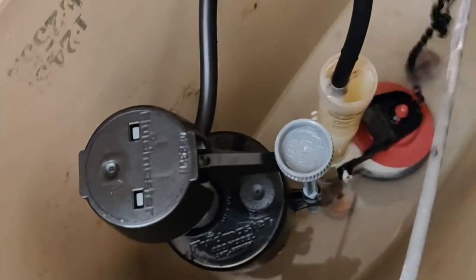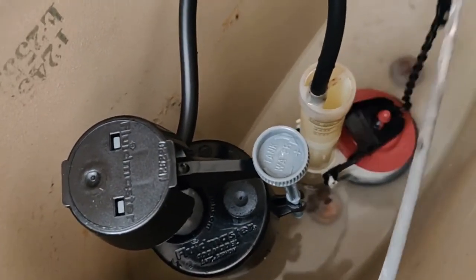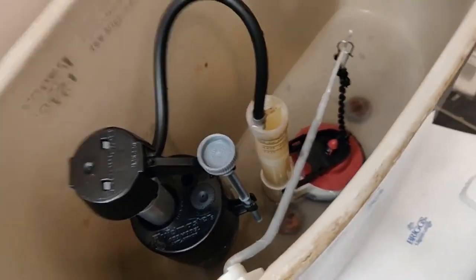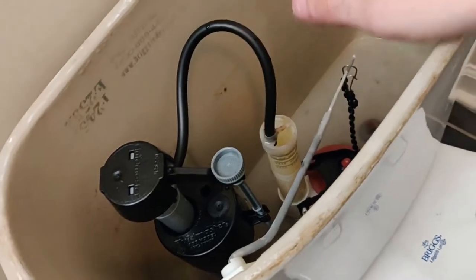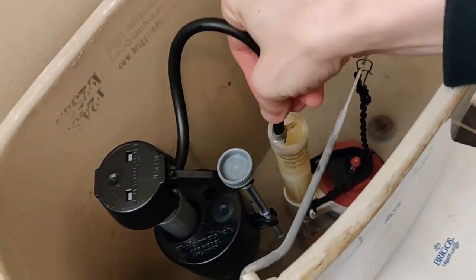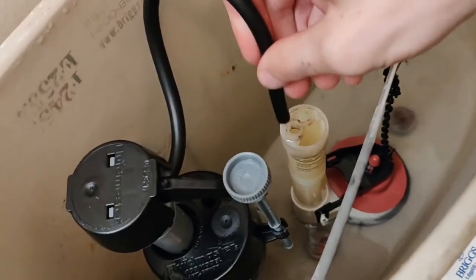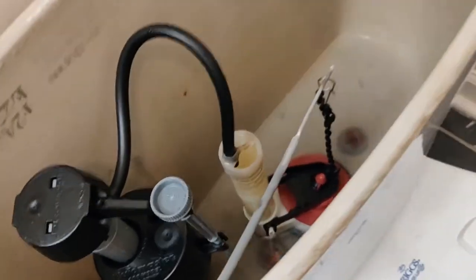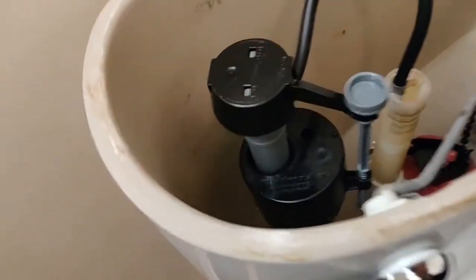This is stuck on the other side. Make sure we're not going to bind up — because that's going to cause the toilet to run constantly and fill constantly and then get a work order on it. Make sure your hose is attached. If you don't have a cut clip like we've got, you gotta add the little clip from the tool pouch that comes with the kit.